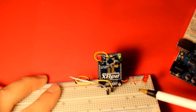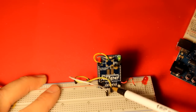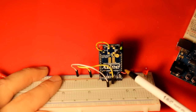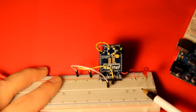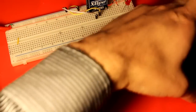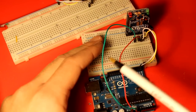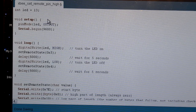To save some time I already built the circuit. We've got ground and plus five volts connected; the red pin is pin D3, connected into the XBee. We learned how to tap off of that from the previous video. That is connected to this LED, which is then connected to a resistor and then to ground — that's the remote side. The coordinator side is the same as the last couple of videos: plus five volts, ground, and TX and RX connected. Let's look at the code for the Arduino.